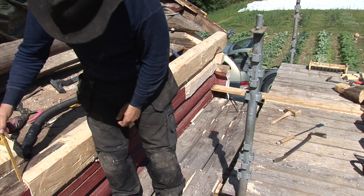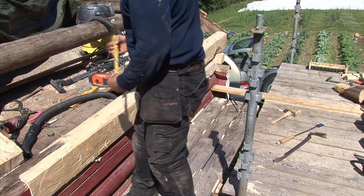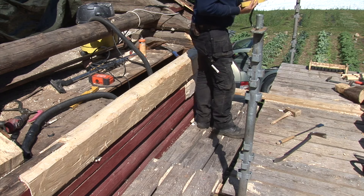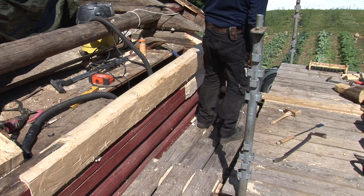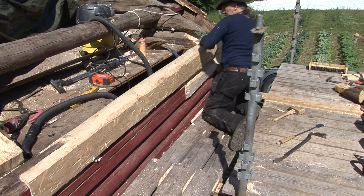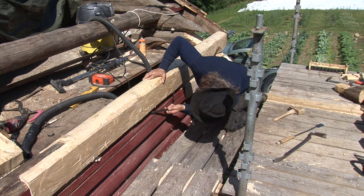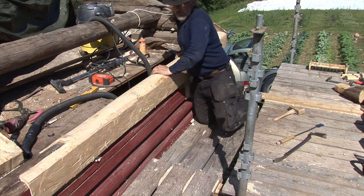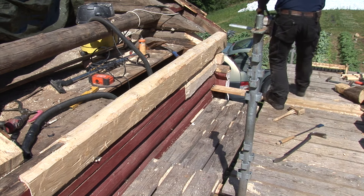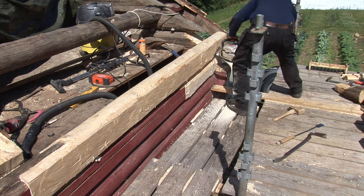This piece of timber is a little bit on the short side — I can only go down about a centimetre, but I'm going to have to do more than that unfortunately. The important thing here is that at no point is it higher than 1.7, and the piece of timber needs to go down low enough to close the gap. This bit in the back here has to be flat. All of the heads on the outside of this building have this air gap between them — it makes the heads last longer. Normally you want to aim for that to be about eight centimetres wide.